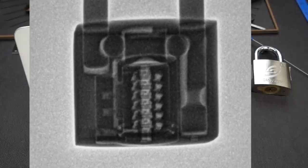So when we rotate the core, those ball bearings just roll along the outside of the core. As long as that sidebar is sticking out there, there's no way that they can push in, and there's no way we're going to get any kind of tension. We're not going to tension the lock. We're not going to tension those sliders. So what this tells me is that we actually have to insert the key. And the sliders, which we can't tension, have to be put in exactly the right position to allow those spring-loaded ball bearings to push against that sidebar, to depress it down inside of the core, so that the core will then rotate. Very, very cool design.